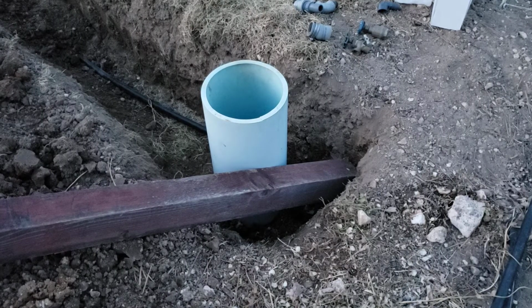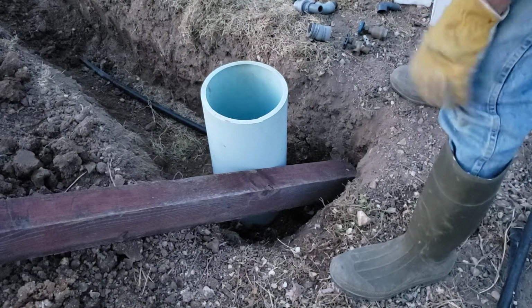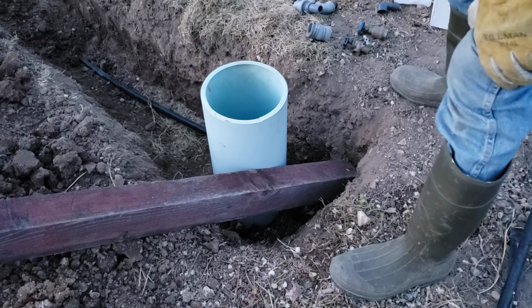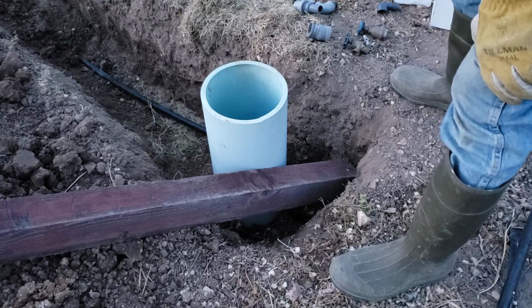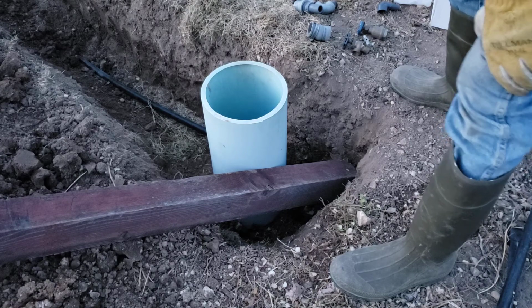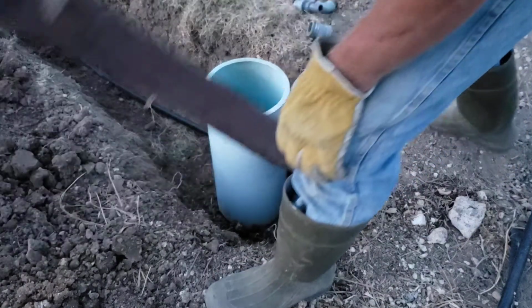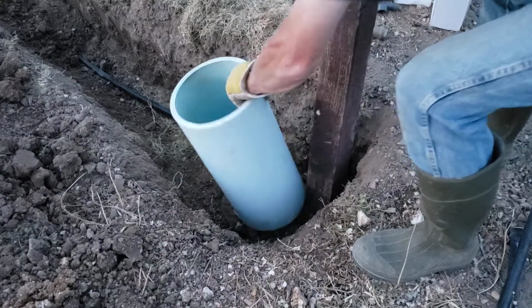I thought about using this standpipe to put a curb key in, because I could turn that off, and when you turn those in-ground valves off, then they drain out. And then this line wouldn't have any water in it in the wintertime. I wouldn't worry about it freezing. But that's really low on the priority list right now. We have access to a spot over here on the other side of the road where I can put a faucet if I want. I could stand it up on a post. I could put the valve in there, but let's not right now.